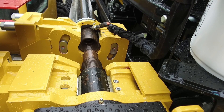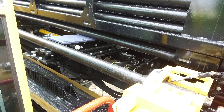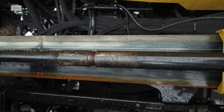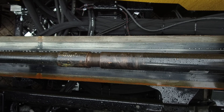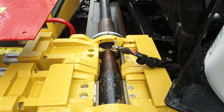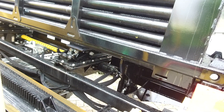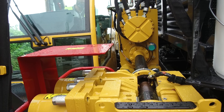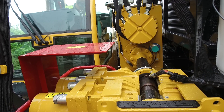Check if the box end of the drill rod is between the end of the upper vise and the beginning of the vise. Now you can extract the rod loader arms. Now close the upper vise again and rotate the sub saver counterclockwise to break the upper joint. Keep rotating until the connection is fully unthreaded. Once the connection is fully broken, you can move the carriage to the back of the rack until it stops. Open the upper vise and the vise will automatically slide down the rack. Now you can store away the rod into the rod box. Move the carriage forward until it stops in front of the vise to grease the sub saver. The carriage will only stop if the greaser setting is set and out of grease.